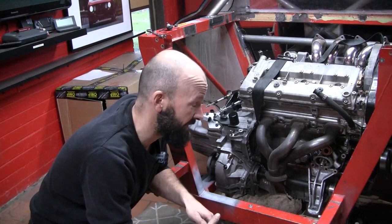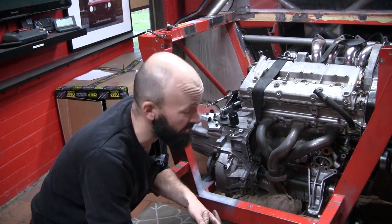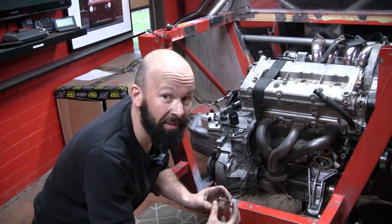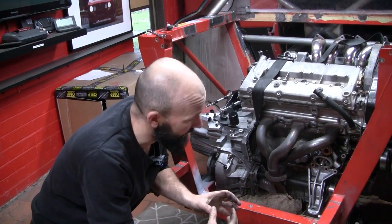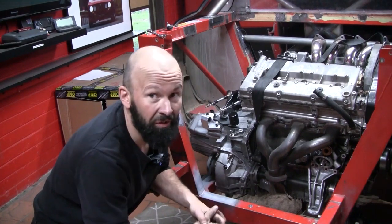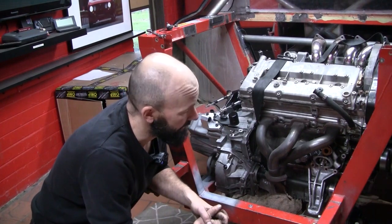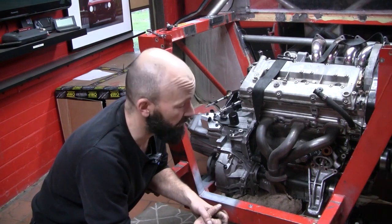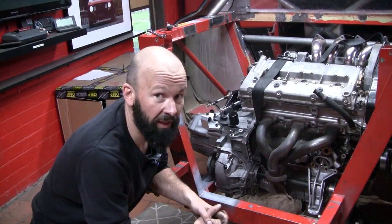The final option I came up with — and the one I'm going to go for — is to machine up an eccentric bearing housing that shifts the bearing out and across to where it's supposed to be. So whilst all of life's problems can be solved with an angle grinder and a welder, I think it's over to the lathe for this one.